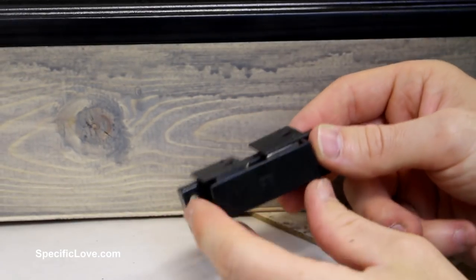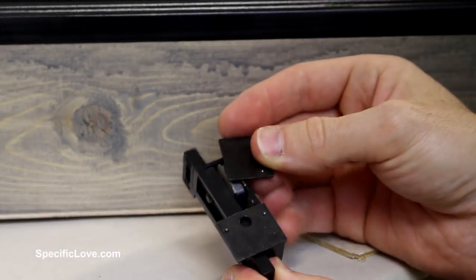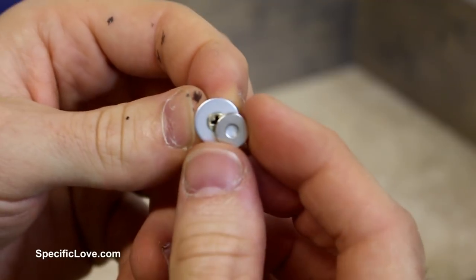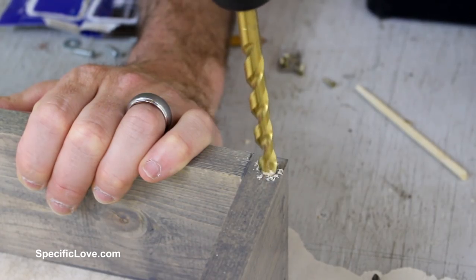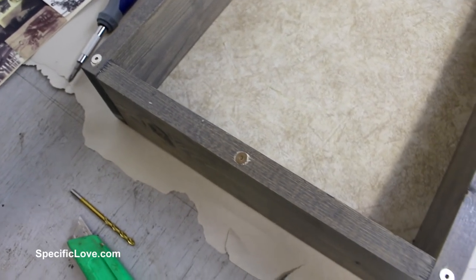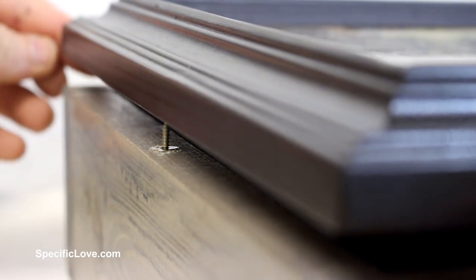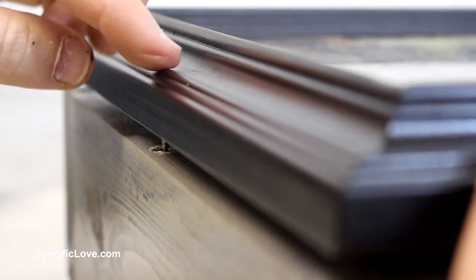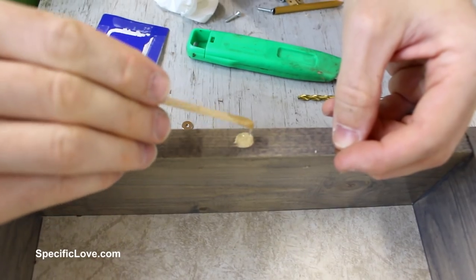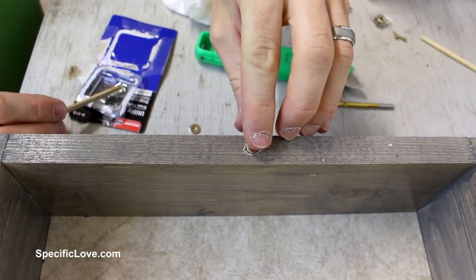I had originally planned to use a magnet lock from an old cabinet, but the distance between the inside of the box and the frame edge was too wide. So my backup plan called for neodymium magnets and small washers. On the outside corners and at the center edge of the box, I carefully drilled a shallow 3/8th inch hole. The hole has to be deep enough to hold the magnet flush with the top edge for maximum surface contact. Using a small screw facing up from within the hole made it easy to mark the center location for the washer on the frame. I then used a two-part epoxy to secure each magnet in each hole. The epoxy also worked well for securing the washers.